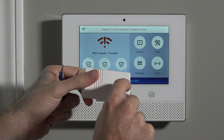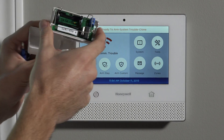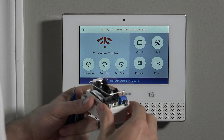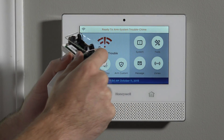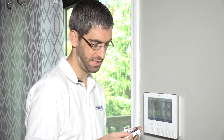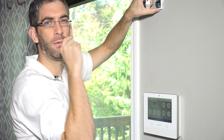It is bigger and boxier for a reason, and I'm going to show you that first. At the base of this arrow is a little tab — you can use your finger to just push that in and this snaps open. On the 5816 circuit board, the wire coming around the top is the antenna, giving it good range back to our Lyric or Honeywell Wireless system. It's got a little tamper switch so if the cover pops off, you know about it. And it's got a little terminal block with two terminal screws — that's why there's really this depth of the sensor. That can be used to wire to an existing wired device, so instead of using the magnet to detect door opening and closing, you could wire this as a wireless transmitter sitting on the wall, wired down to a wired contact that's actually detecting the intrusion.